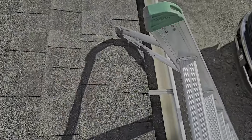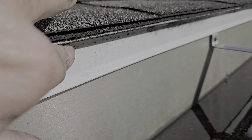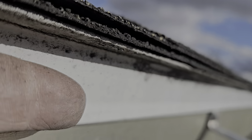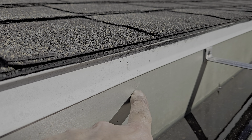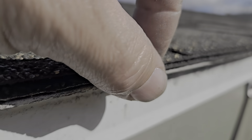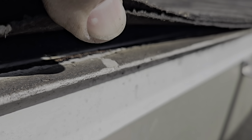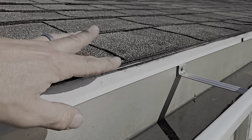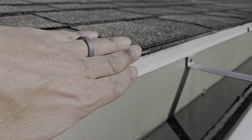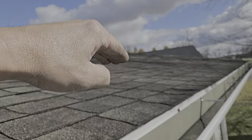One other thing down here is the bottom edge. I've talked about the different metal used at the bottom. This is drip edge — it's for a gable. It has a lip that comes out right here. You don't really want that on a bottom eave. There's an apron that goes on the bottom, and the reason they use an apron is because it goes down into your gutter farther or over your fascia board farther. It allows you to not have water wick up under. You don't want to hang your shingles down too far because water surface tension easily wicks right up under there. You hang your starter down a little bit, hang your shingle down a little bit — when it heats up it'll curl down, giving a lip for water to run off rather than wicking up under due to surface tension.